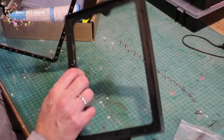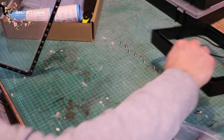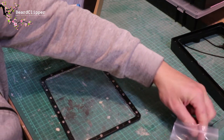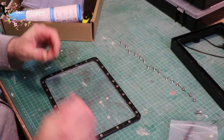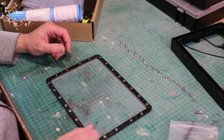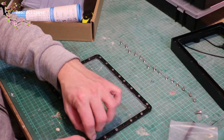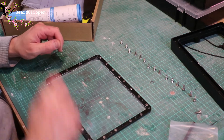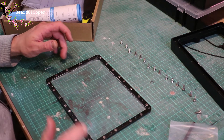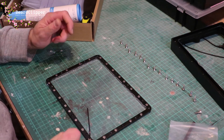I'll wash that before I put it back in again, because you can see there has been some resin leaked into it. My guess is that the FEP you get factory fitted on Elegoos is not great — not really well done. I had a very early leak in my Mars 2 and that should not have had any resin at that point at all. I'm thinking it wasn't done properly and probably not tight enough, though I've got no empirical evidence for that — it's purely my own experience.